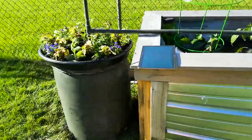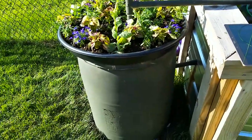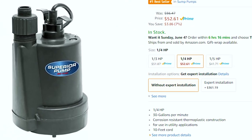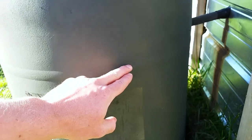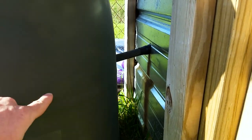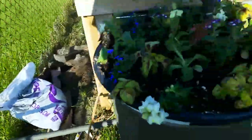The main thing here is this rain barrel. It's actually just an old barrel I had that I used for my pool but I'm not using it anymore. The way it works is there is an old sump pump in here, similar to this one, and it's an old backup sump pump that runs off 12 volts, sitting at the bottom. The water level is about right here or so — this is about the max. As you can see, the drain from the garden comes into here, refills it, and then there's an overflow on the other side.